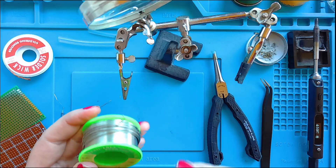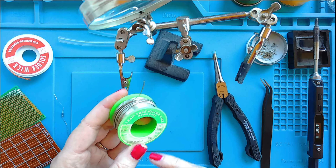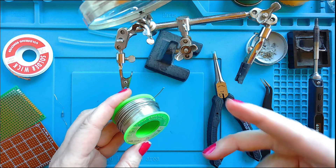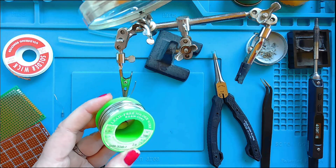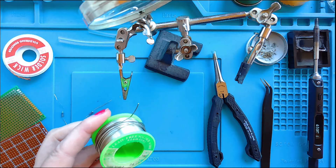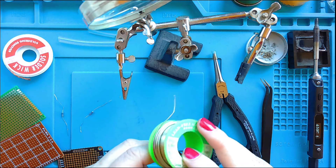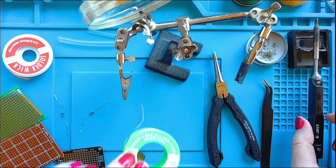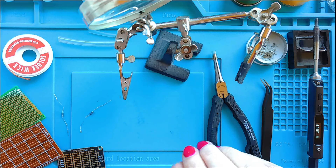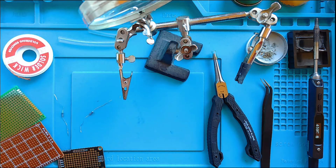Check the temperature that is your melt point — you may want to do a few starter circuits if you've got a new solder. I usually go for lead free, and it usually has a melt point of about 200–220 degrees. The leaded ones are usually a bit lower, about 180. The leaded solder does make it a little easier, but it's up to you.